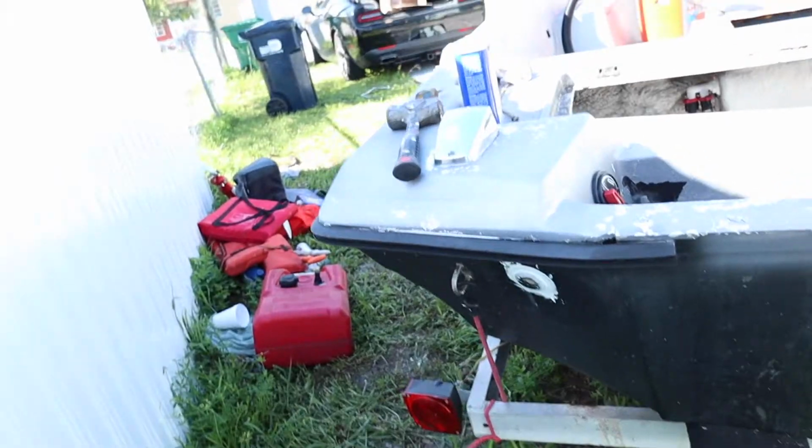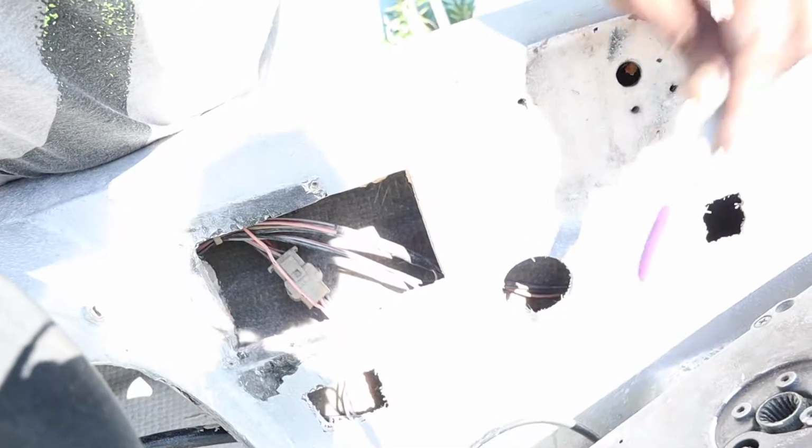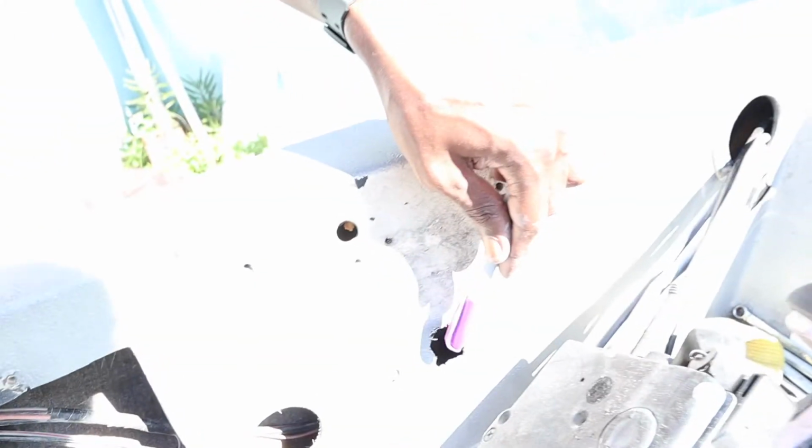Got our panel for our battery gauge cut out. What else did we do? Our main thing was just to finish this off, man. And we got our switch panel cut out, as y'all can see. Right here, this is gonna be the Johnson three-way switch. It's gonna be the 6-gang switch panel right here. This is gonna be the aerator. This is gonna be the actuator cable and the knob for the live well, and that's our live well timer switch thing right there.